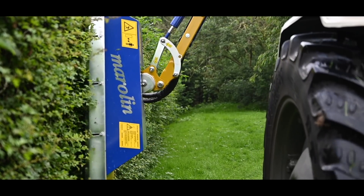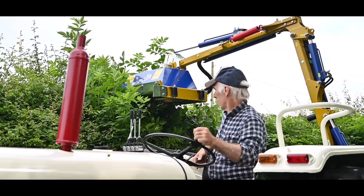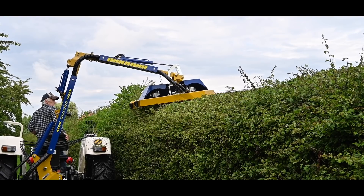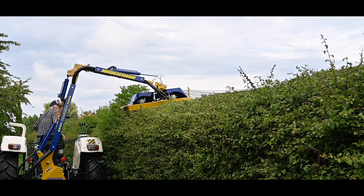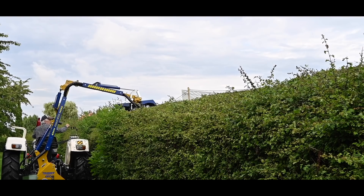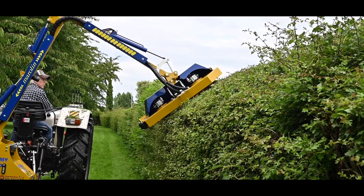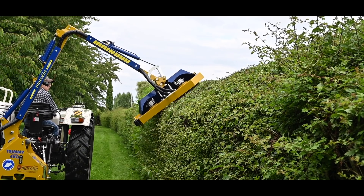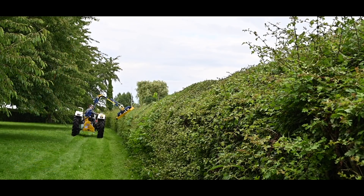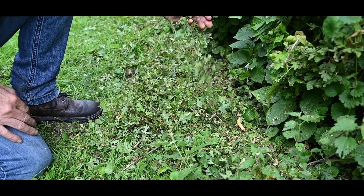So you have to keep adjusting — it would be great to have an automatic leveling system but that's not available here. Here I'm cutting off the top with some real big branches. I didn't extend the trimmer far enough to the outside so some branches are left on the other side. You can see the trimmer digging into the hedge a little bit every so often while the tractor hits a ditch. I'm also not having it fully horizontal — just trying and exercising. This is going to take a little practice before you have it under full control. But all in all this is working pretty well.